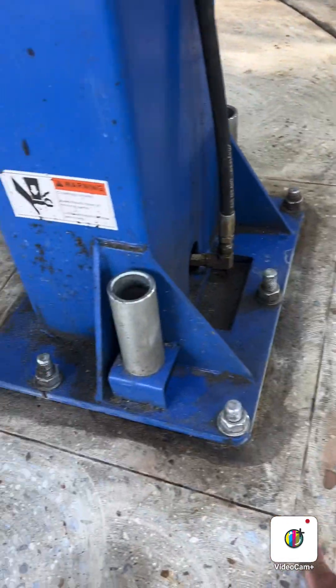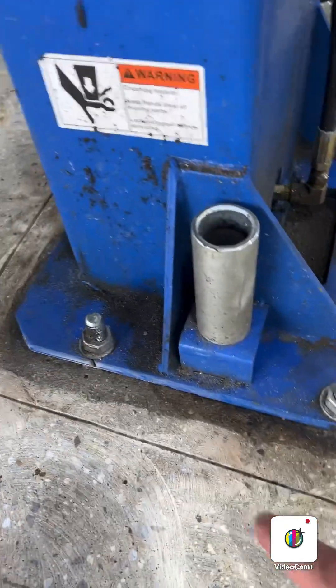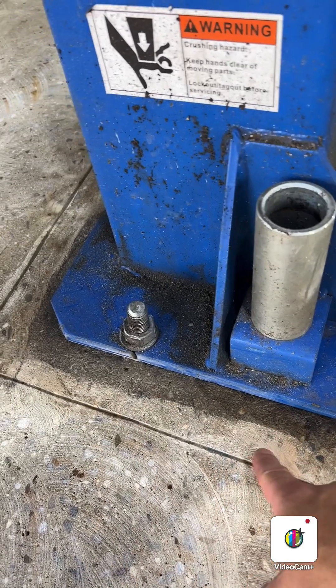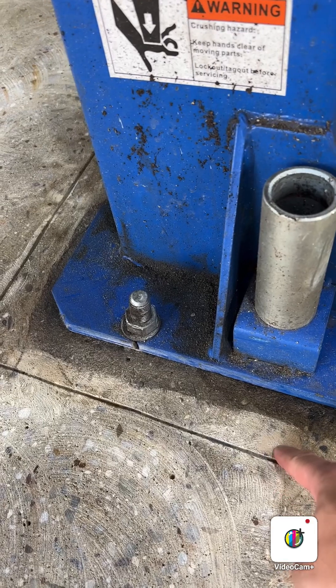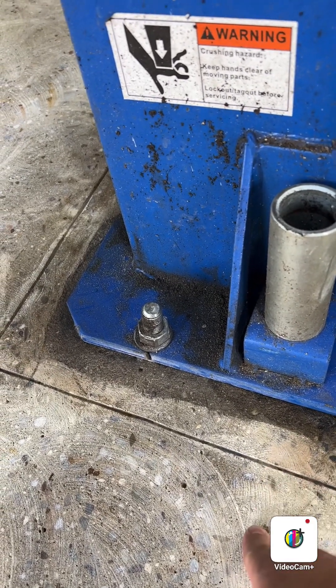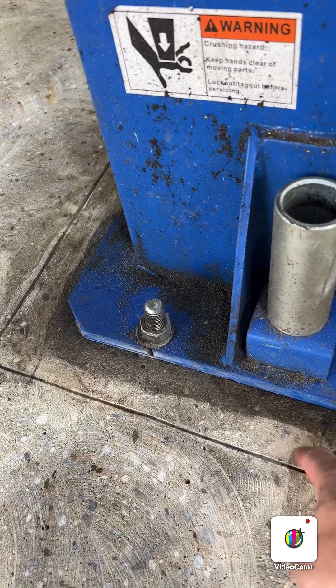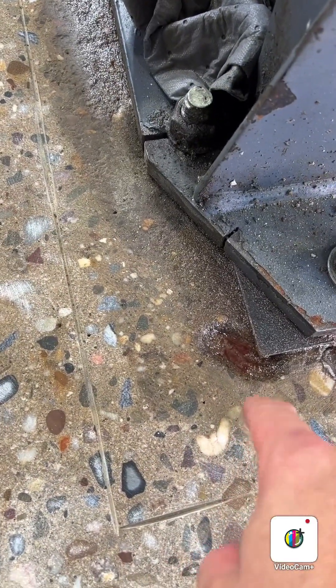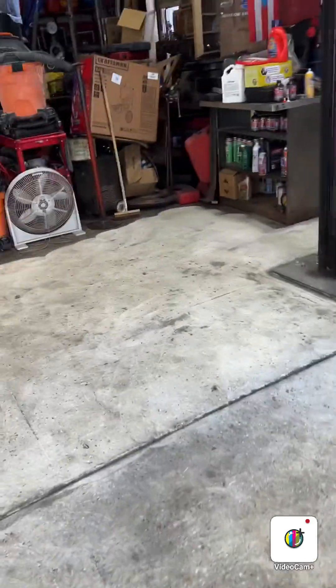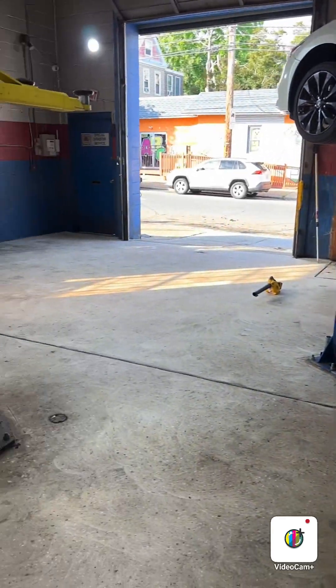I did this line — it's a square — because it's leaking hydraulic oil. I'm gonna paint this anyway, I'm gonna paint everything. But like I told the owner, there's a chance this part is gonna peel off. What I did is called an anchor cut — so when it starts to peel off, it's gonna stop right here and be secure. This area has a chance of failing because the hydraulic oil keeps leaking. I cleaned it but it keeps leaking, so it's not gonna stick 100%. It'll fail right there, but everything else is gonna be good.